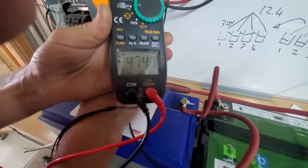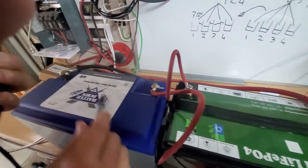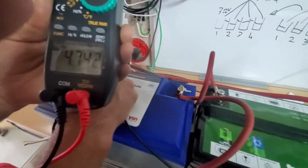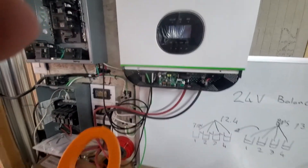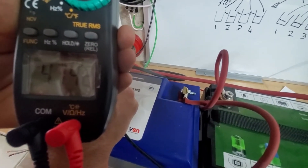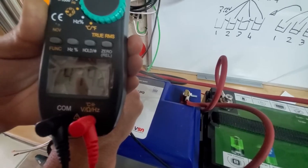You see how the lie comes across: when we take them out of circuit we saw 24–25 volts, but when we put them across the inverter it won't turn on. Many people disconnect the batteries from the inverter, measure the voltage, and get the lie voltage. You need to measure while connected.